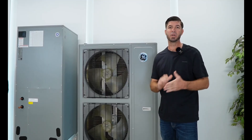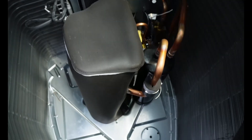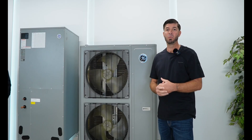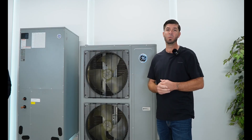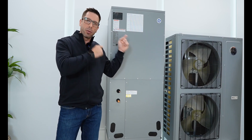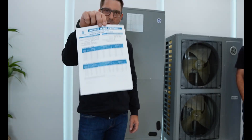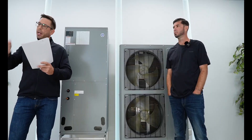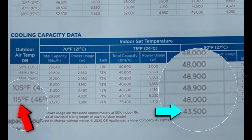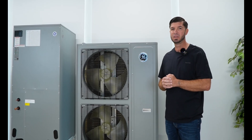But not this guy — absolutely not this one. In our last recording, we demonstrated two 3-ton heat pumps: one was a popular inexpensive version, and the other was arguably the most expensive heat pump on the market today. When ambient temperatures hit extremes, the cheap heat pump went from 3-ton to 1-ton, while the more expensive one went from 3-ton to 2-ton. The specifications for this system are absolutely amazing. At 115 degrees, it only loses a few thousand BTUs — in cooling mode it doesn't even drop to 3.5-ton. It's still above 3.5-ton BTUs at 115 degrees.